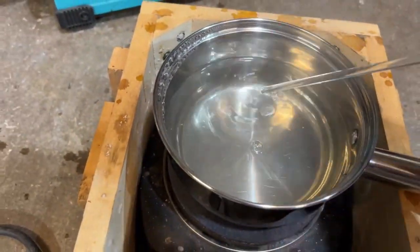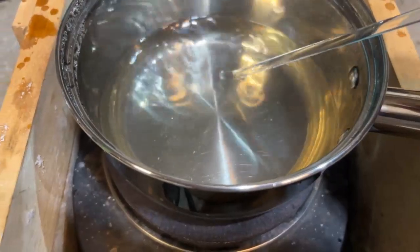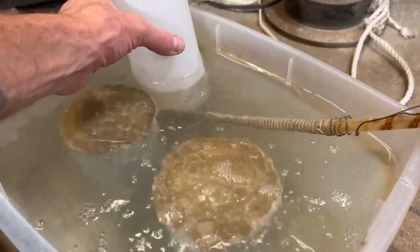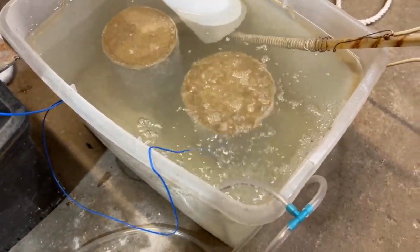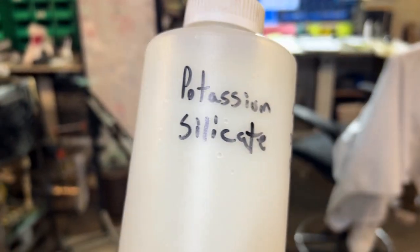What I'm going to do is boil this stuff down until I can swizzle some material off the top. We've reached the point — see how the top is kind of clinging together? We're going to go ahead and dump this into a glass container and check its volume. I set it on top of my other experiment here because this stuff is so hot I didn't want to melt the bottle. This is what we came up with — this is the ratio right here, and this makes our potassium silicate.